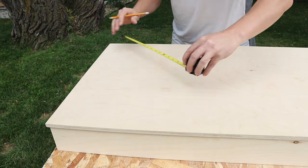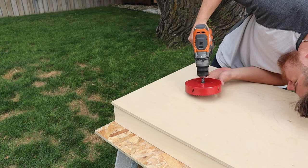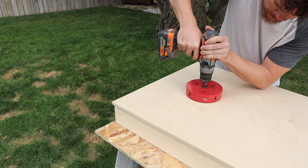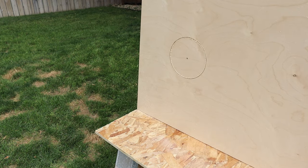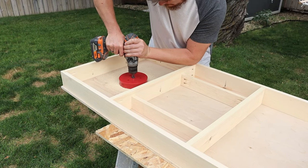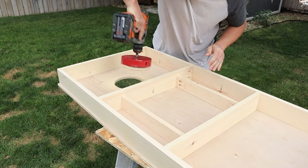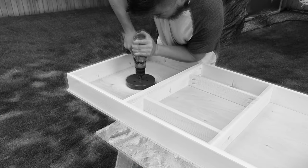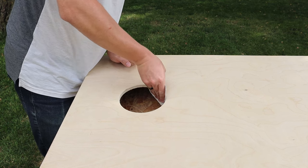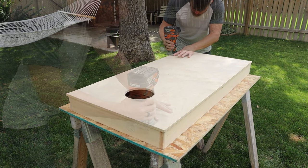Now we need to add a hole so somebody can score — anyway, I'm leaving it in. It's nine inches down from the top center of the board and it's a six-inch hole. I bought this hole saw online — I'll have a link below. This six-inch hole saw has a ton of torque; if it grabs and bites the wood it can kick pretty hard. I'm starting my cut on the top and finishing it through the bottom so it cuts all the wood fibers on both sides, giving less chance for tear-out especially in plywood. After a little bit of cleanup with hand sandpaper we can take a quarter-inch round-over bit to the entire edges of the top as well as the hole itself.